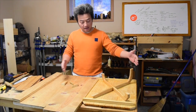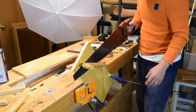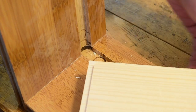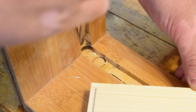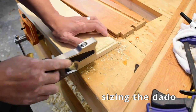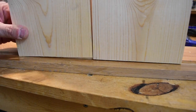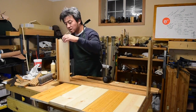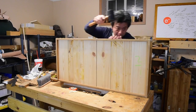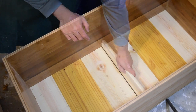Between these four pieces I have just about the right length to cover the bottom. Before I can fit the bottom into the grooves, I need to square off this corner. When assembling the bottom, I put glue along the face grains but very little on the end grains, and I left the middle part unglued because I'm going to add a divider and use that to push all the pieces to the side.